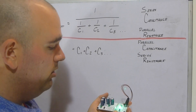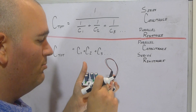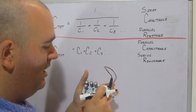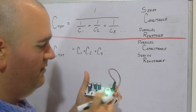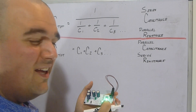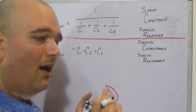Switching on our board, we can see that in parallel the resistance is only 430 ohms, so a lot of current gets through the LED — it's very bright. In series, everything sums to over 20,000 ohms, which is way more than an LED needs. Normally you'd use about 470 ohms to run an LED, so at 20,000 ohms we get a pretty dim, boring little light.